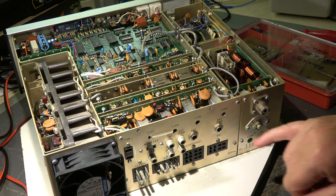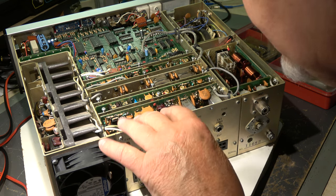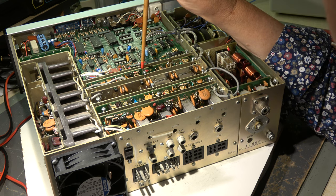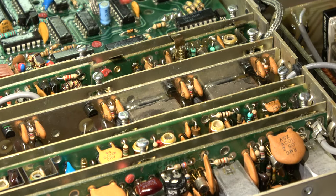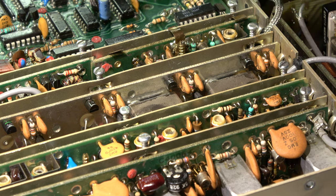I removed the wire to the cinch connector — it had no influence on the receiver sensitivity, so that's not the cause of the problem. What caught my attention is this noise blanker board, and it is not seated correctly as you can see here. It is squeezed behind this board and not in the slot as it should be, and it's rather close to the chassis. Maybe there's a short, and when we switch on the noise blanker we get a short, as we've seen.